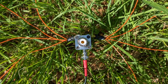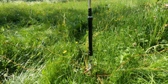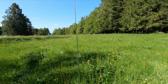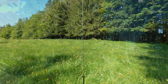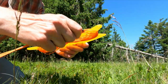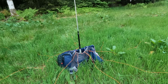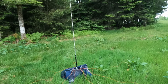With that sorted, I could focus on the ground radials. After some reading and modeling I decided to go for eight 2.6 meter long radials — always a trade-off regarding weight, simple deployment, and efficiency. For easy setup I added a small loop to each radial to easily attach it to the wire winder. When the soil is too hard for the ground spike I either use some stones or my backpack to hold the antenna more or less vertical.